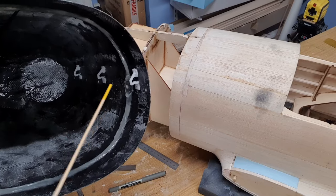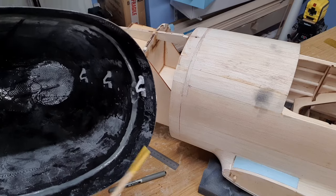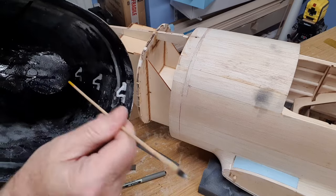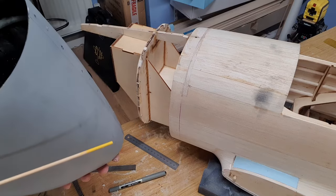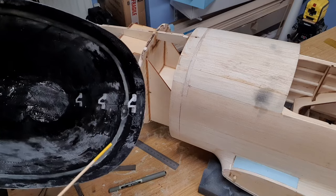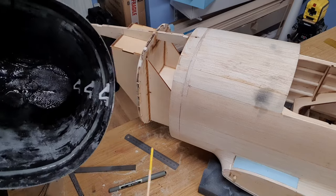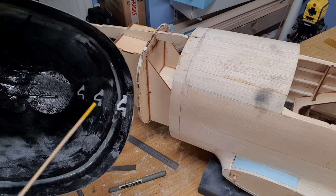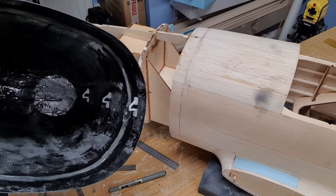So you must not put any strain on these hinges that actually forces the piano wire to curve. So you can eyeball down the piano wire and make sure that they're all nice and straight and not being deformed. So what we've got to do now is leave that for a couple of hours to go nice and hard. Then we'll take screws out that are holding it in, and we'll fold these sides out of the way and put globs on there and close those down.